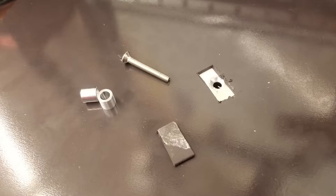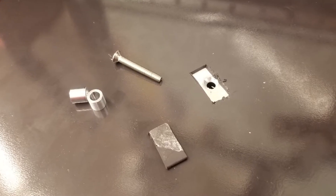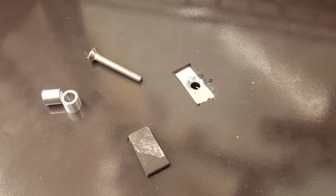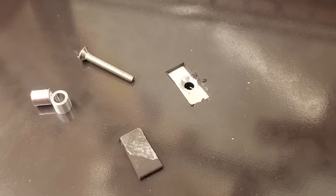In the end, I just had to remove the magnetic plate, cut into the magnet, and remove that center peg. And as soon as I did that, I was getting much, much better prints.